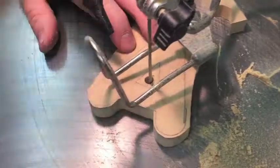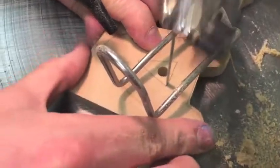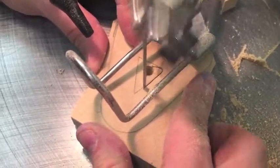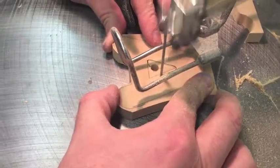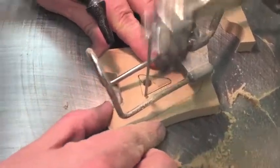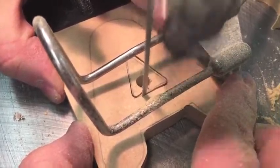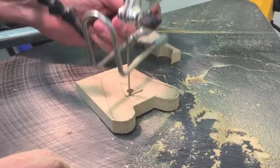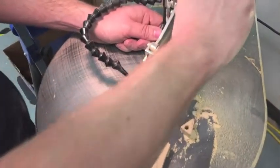See, you're inside. Turn it on, and slowly follow your line. Here we go. Stop. Now, same thing. Pressure down. Lock, lift, remove your project. Make sure that when you install the blade, you tighten it up and you bring back the pressure.